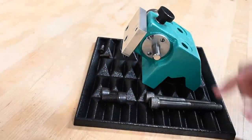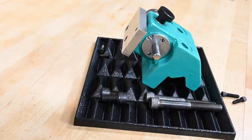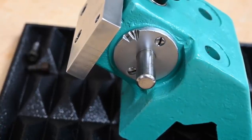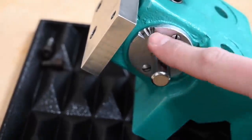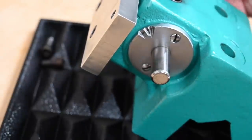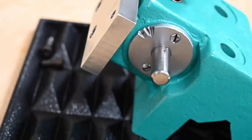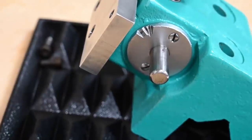I don't know if it has anything to do with that feature or not, but there is some damage to the front flange of the micrometer. I don't know how that would have happened or what you would have been doing to have those gouges there, but somehow along the way this got pretty gnarly right there. You can see a little bit of pitting on the spindle, but it'll still work just fine as a carriage stop. One thing that was missing was the actual clamp plate that goes underneath, so as we talk some more, we'll go ahead and make a new one.